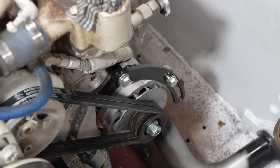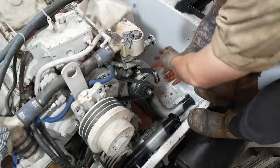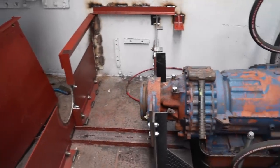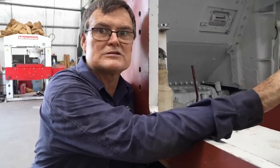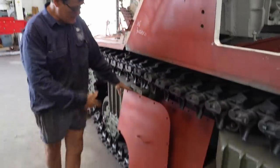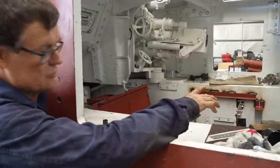This is the alternator for our vehicle. I just made the swing bracket for the alternator — if you undo this, that's what allows it to pivot so you can get the belts on and off and also tension them. While Jesse took a few weeks of hard-earned annual leave, Daryl got to work on the fighting compartment. I started fitting out some of the internal components and we've had to make up new bulkheads to match the shape of the transmission.